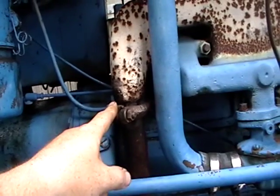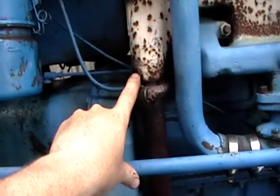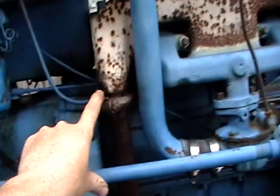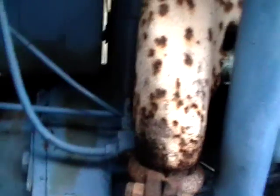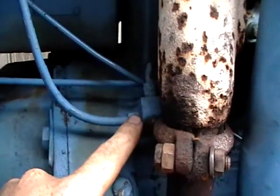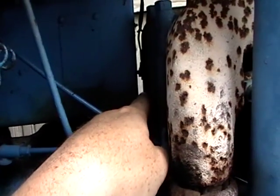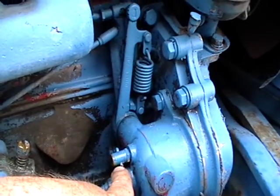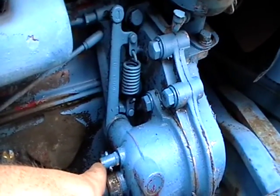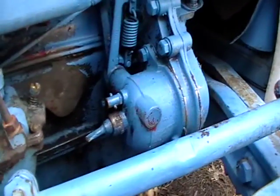The exhaust clamp here — we got an exhaust leak, but I guess that's pretty common for these. As you can see here, the oil comes out here, goes to the front where your oil canister is, gets filtered through that, comes back around here, and I think it's supposed to go right into there. There's some kind of little check ball thing — it works fine.